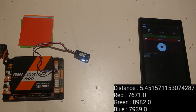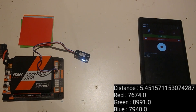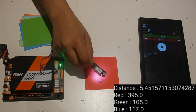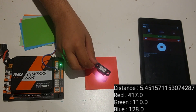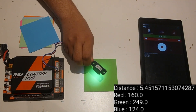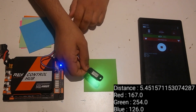You can see right now that the values are very even for red, green, and blue in the telemetry — this is because it's seeing white. For white, all three values are going to be very high; for black, all three values are going to be very low. I have a red piece of paper here, and if I shine it on the sensor from a few centimeters away, you can see the red value is much higher than the green and blue values. Your robot can easily detect that it is red.